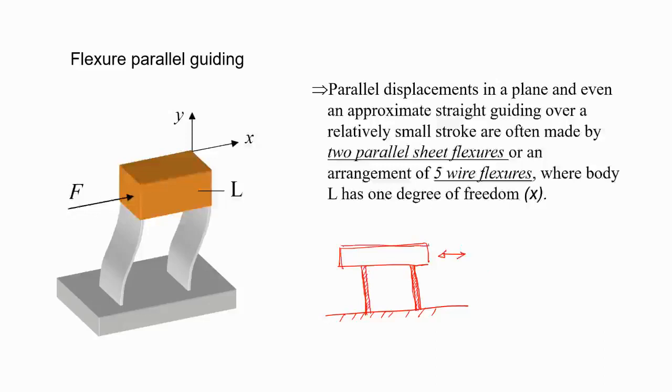So that's the idea. And I think earlier we also discussed that although we have two leaf springs, one and two, constraining three degrees of freedom each, still there will be 1 degree of freedom which will always be there. You cannot constrain all 6 degrees of freedom, and with the over constraint and the degrees of freedom, what is left is in the same direction. Of course, the rotation and translation will exchange.